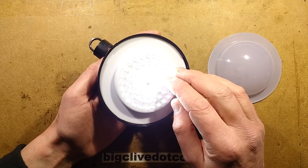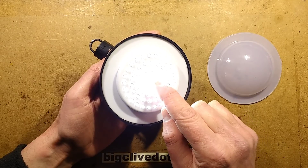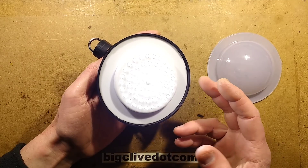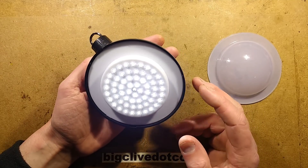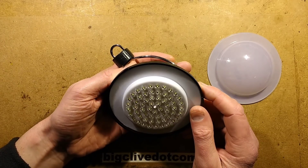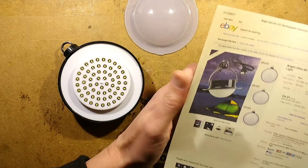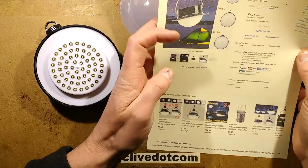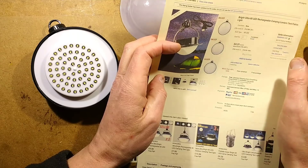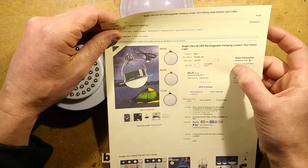The next setting lights the outer set as well — a total of 25, 18, 12, and 5 — to give 60 LEDs. When it goes up to full intensity, it draws about an amp, which equates to about 15 or 16 milliamps per LED. The seller this came from was a generic eBay seller. There are so many of them selling the same thing. They sold 12, 36, and 60 LED versions.